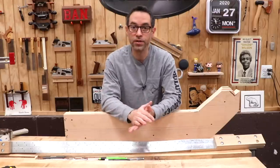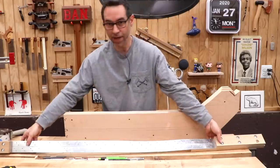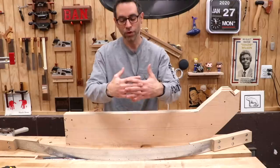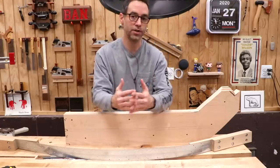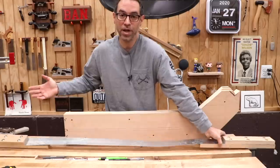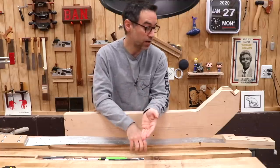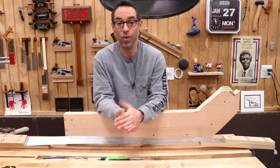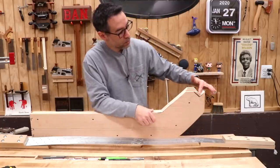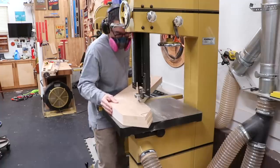Before steaming the air-dried stock, I'm evaluating what I've done and trying to improve. One very important thing I've learned is this concept of a backing strap that supports the fibers and encourages compression. Wood does not like to stretch — that's when you get splits and breaks — but it can compress. A strap with blocks on the ends pressed right up against the workpiece, as you bend it, holds everything in and causes the wood to compress rather than stretch. This is a mainstay of steam bending, and apparently I can't get away without it.